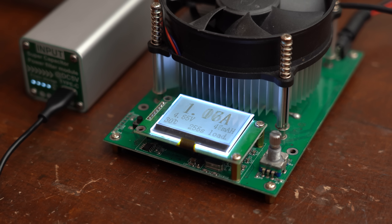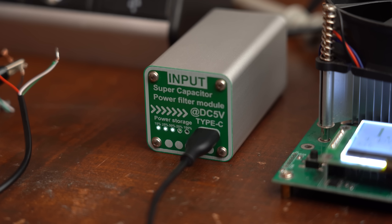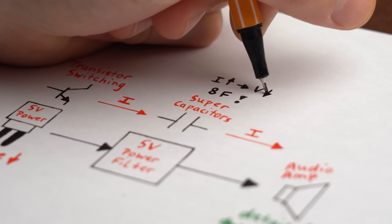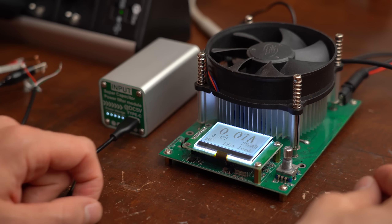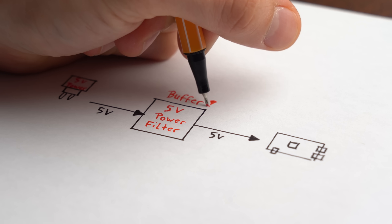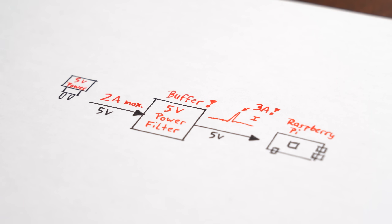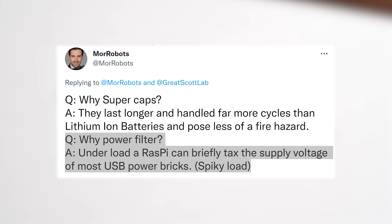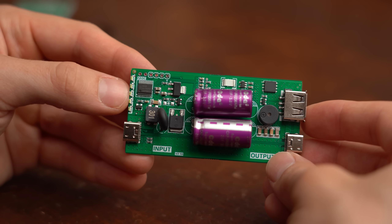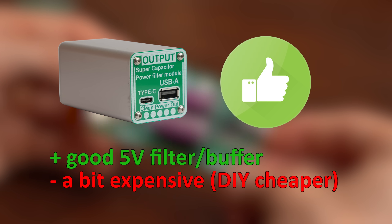But while going up with the current draw I noticed that the output voltage dropped a bit, while the filtering still worked out just fine. The reason is that the supercapacitors obviously come with a limited capacity which reduces their voltage level at a higher output current, meaning this product is only suitable for low power filtering. Besides the filter feature, this product can also be used as a kind of buffer if your Raspberry Pi requires sudden current spikes that your power supply cannot offer. So overall this product is not half bad if you are facing filter or buffer problems, and since its build quality is also rather professional, I kind of recommend it even though I think you could DIY it for a bit cheaper.